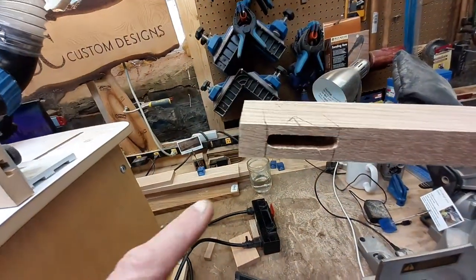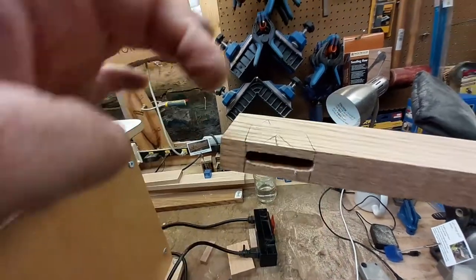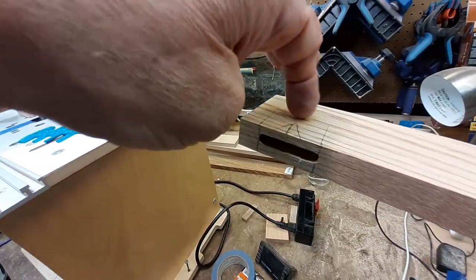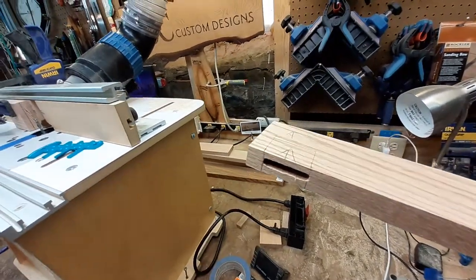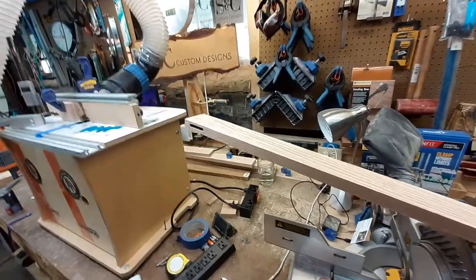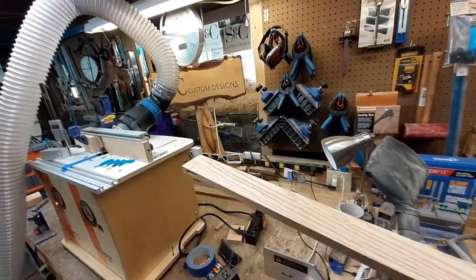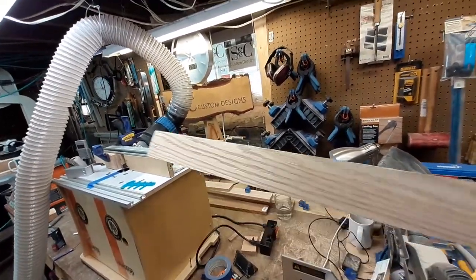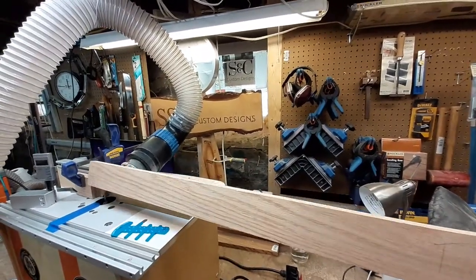Here I already routed this area out. You're going to want to go a little bit farther than the actual depth you have there — room for expansion when it gets dry out. I'm in the northeast so I have all kinds of different weather up here. I'm going to try to show you this in action. I'm a one-man show, so I find that I make more mistakes when I have to stop and do videos, but I am going to video over there at the bandsaw cutting out the tenons.